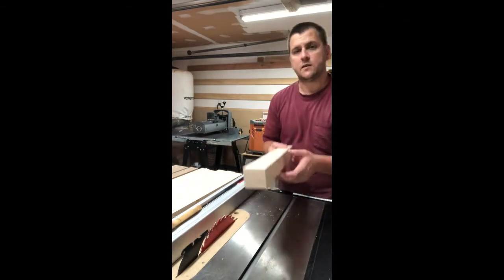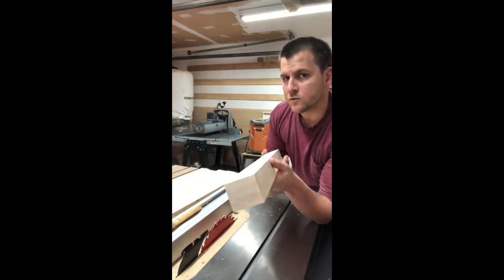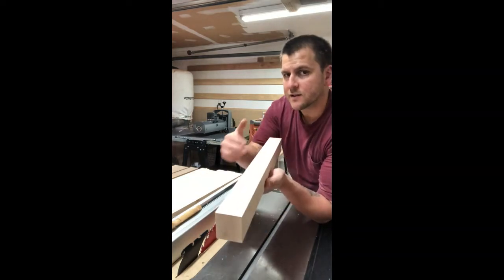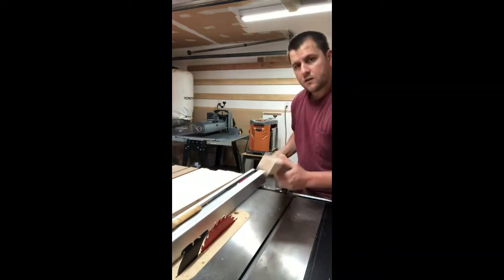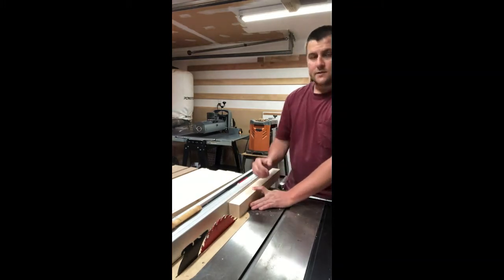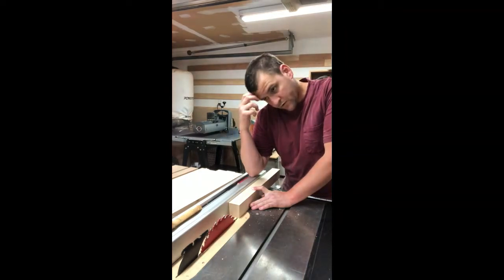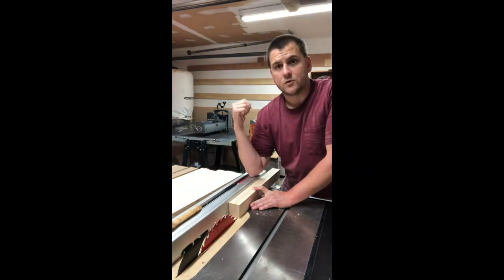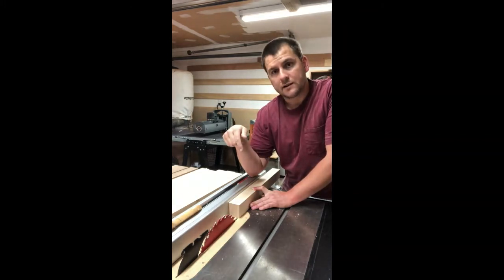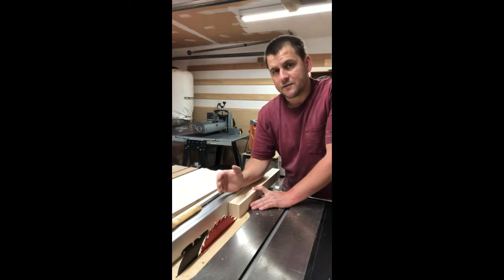So next, now you've got 2 1/16 inch wide, face grain up. You're going to rotate it on its edge, right? Edge grain, long grain, whatever. You're going to put that up, okay? Now this is kind of optional, unless you took it down to 1.5 inches on your planer or drum sander, whatever you want to do, whatever you feel comfortable doing. I like doing it this way. I got my fence set to 1.5 inches. This is the point where it has to be 1.5 inches.